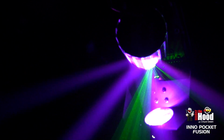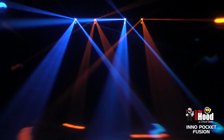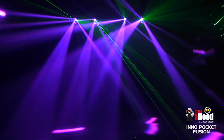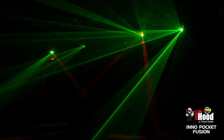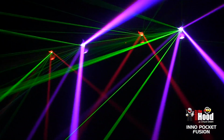As mentioned earlier, the Inno Pocket Fusion uses a 12-watt LED, it has a barreled mirror, and it also has a Micro Galaxian style laser effect. It has 7 colors plus white, it has 3 operational modes: DMX, sound active, and its internal shows that can be triggered sound active, and you can link them up master slave. For those of you that are using DMX, it has 5 DMX channel modes. You can use 2 channel, 6 channel, 8 channel, 9 channel, or 11 channel. It has 8 built-in shows.